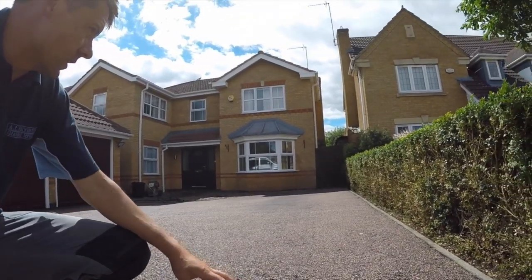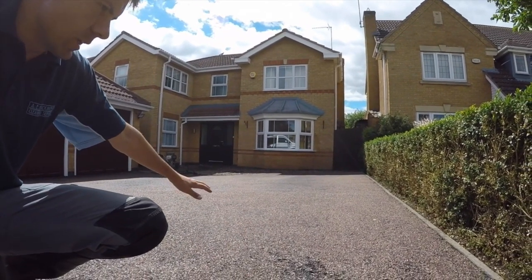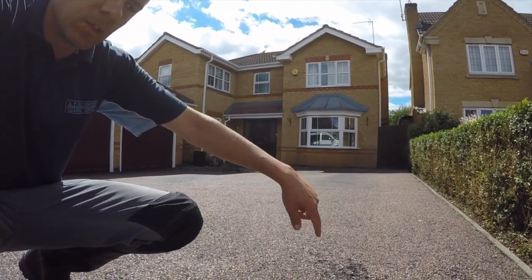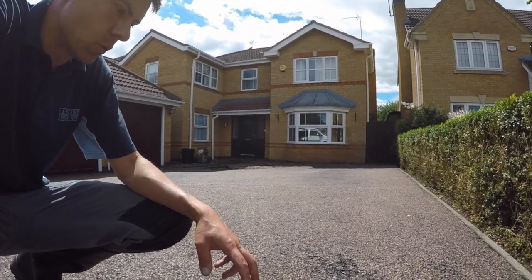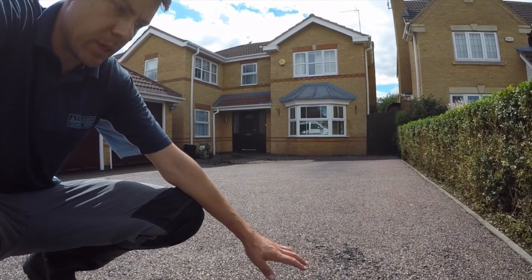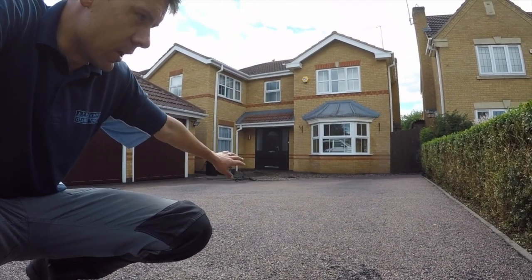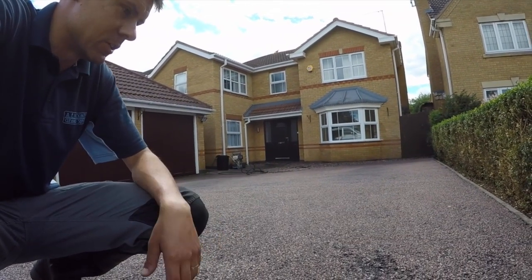So you can see what I've done here after going over it with the flat surface cleaner. I've overlapped each row as much as I can and gone over it quite slowly. The slower you go, the more rotations of the jet go over the surface, so that's a better way of cleaning it more thoroughly. I wanted to get up any of the loose paint that was previously applied and remove as much of that as I can. After going over it the first time, I gave it a good rinse to get rid of all that muck and sludge — surprising how much is created.